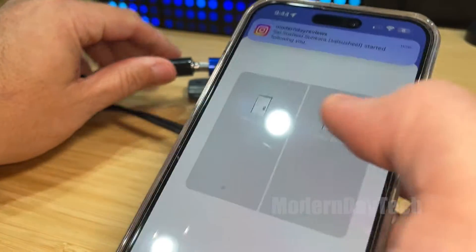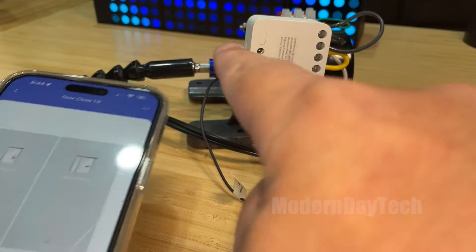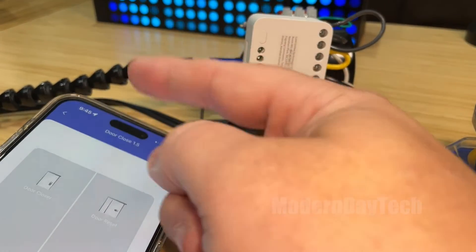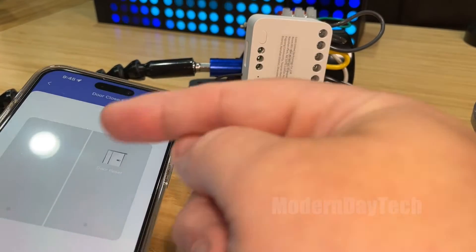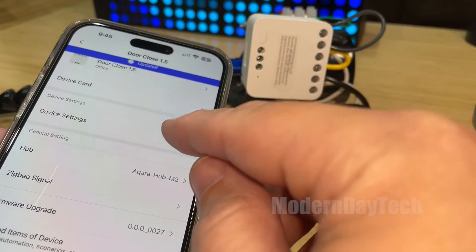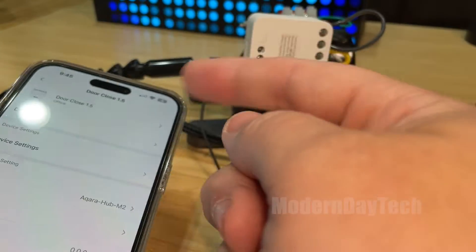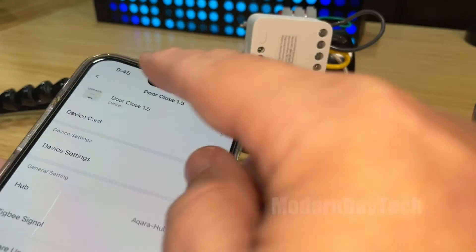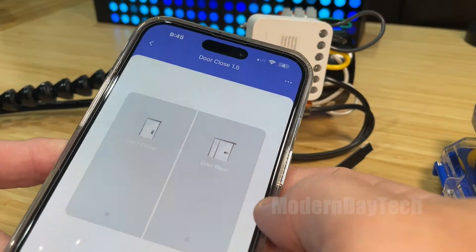I have it here and here are your two switches. Because you have two loads on here, this acts like a shutter motor — it's going to move the motor one direction with one load and then move it in the other direction with the other button. They do have what's called an interlock mode, which you do want to turn on. That will prevent both switches from being on at the same time, because having them on simultaneously would probably burn up the motor.